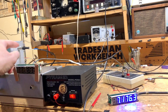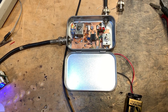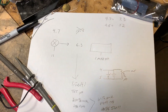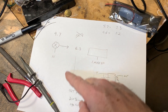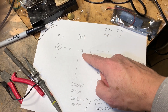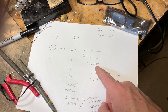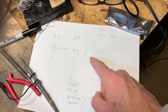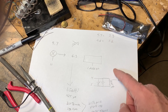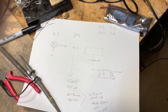Anyway, it's working. It's receiving the signal here. Let me show you the device. Here it is — it's an NE602, and my scheme for doing this is described here. Got 4.7 MHz coming from the VFO, I have an 11 MHz crystal in there. It results in two output frequencies: 15.7 and 6.3. We want to reject the 15.7 and go with 6.3 into the counter. I'm going to select a 1 MHz IF for the counter — 1 MHz plus 6.3 will give you the correct result of 7.3.